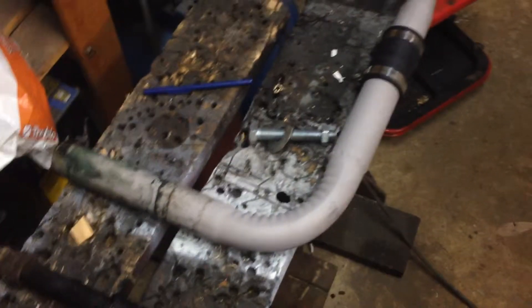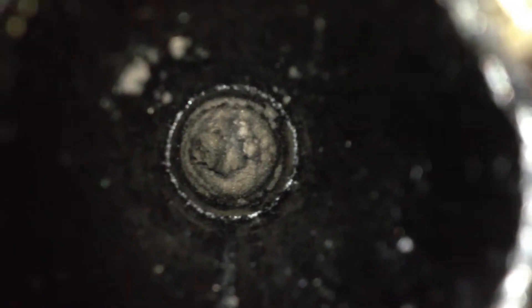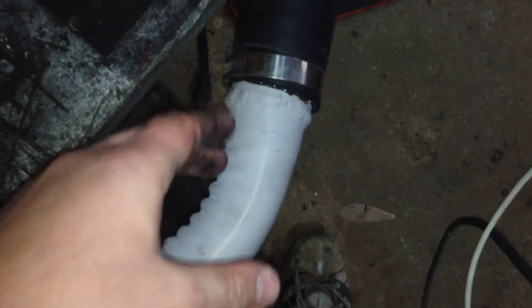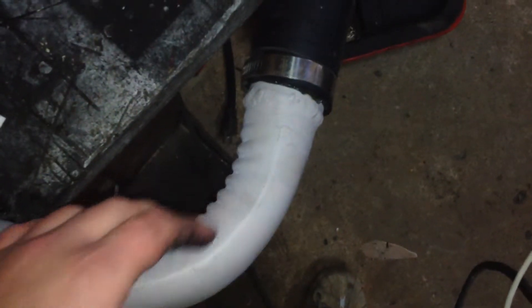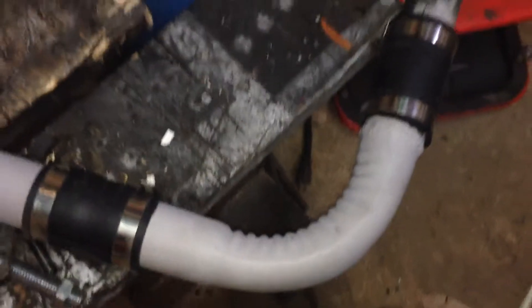This pipe here was the main pipe that came from the top of the barrel. I want to show you guys what's actually inside and what kind of clogging can happen. Look at that — there is a hole in there, but this thing is clogged up. I need to find a way to maybe make these pipes smoother. I think it's the ridges on here that really start to clog — it's like an artery. Once it's tarry, all that soot starts to collect in here and it can get really bad.